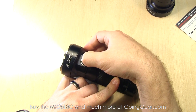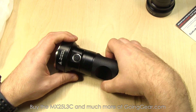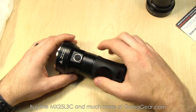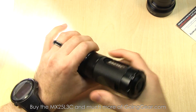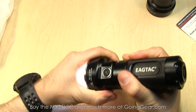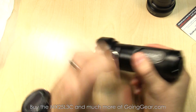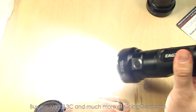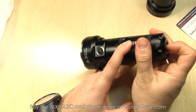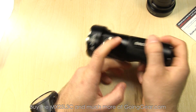If you have it turned on in any mode, press and then press and hold, you have strobe — you can get into that from any of the different outputs or modes, including from off. Release it and it'll go back into the mode you last had it in. To cycle through outputs, loosen the head — you have four different outputs in regular operating mode. With mode memory, if you turn it off and back on you'll return to that mode. From any mode, press and hold and it'll go right into max output as a momentary — when you release it, it goes back to the output you had last.